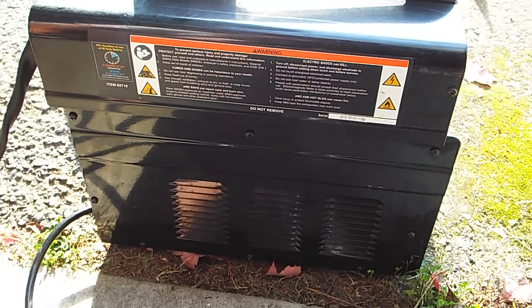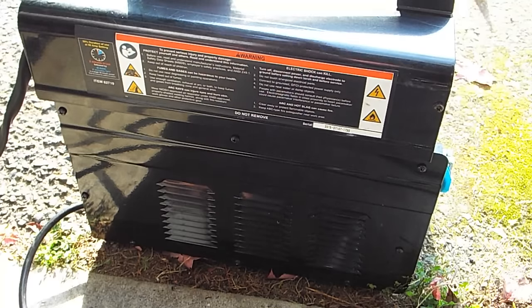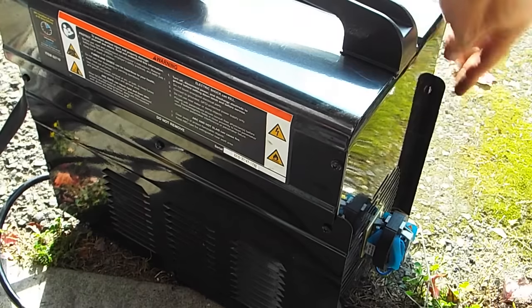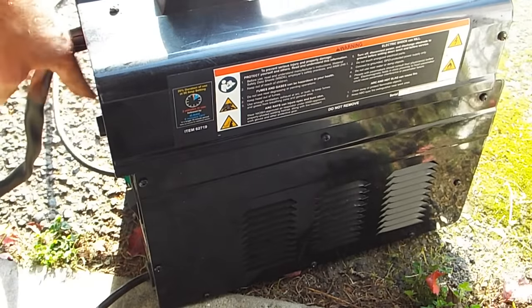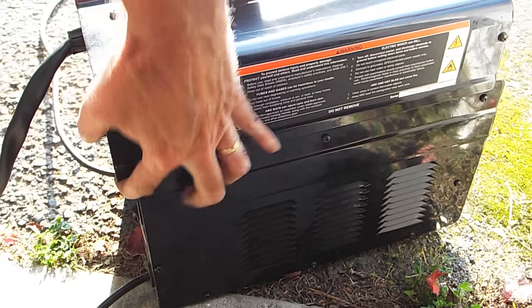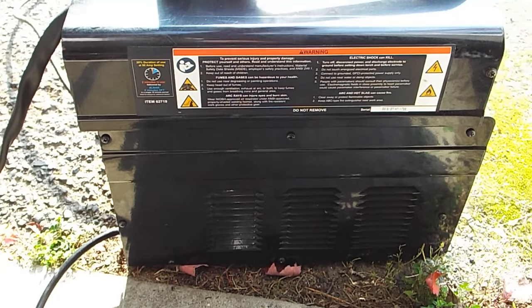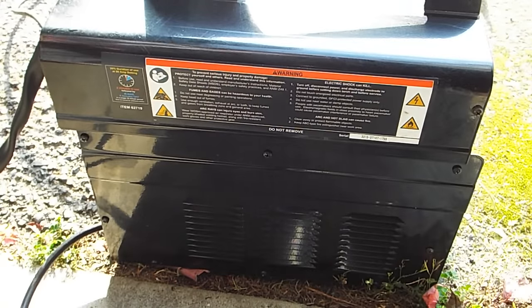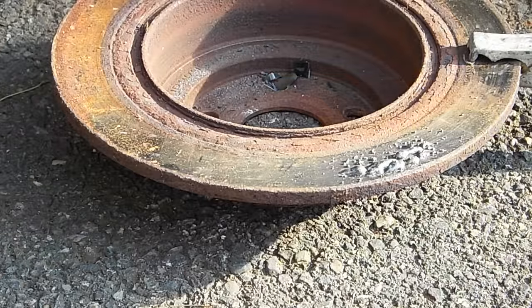Here's a sign that I'm not perfect: I actually swapped the side covers — they're on the wrong sides now, so the extended part sticks out in the back. That might actually help protect the motor until I get a bracket across here, and the front is now smooth all the way across, though that does expose the buttons to potential damage. The front cover no longer lines up with anything since it's now on the back. It's too late to switch the covers around because the rectifier is mounted on the other side. Also, I bought six feet of number six gauge wire and that last two inches is all I've got left.